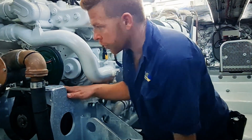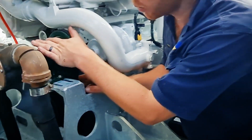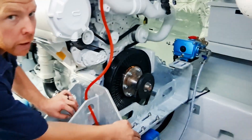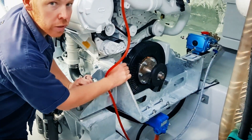While we're talking about the front, you can see that there are additional components fitted to these engines: a deck wash pump, an additional house bank alternator on the starboard motor. Over on this side we've got the power steering pump down low, and we're shortly going to have a desalination pump fitted as well.